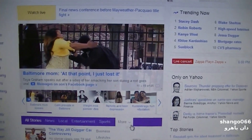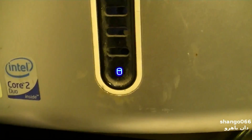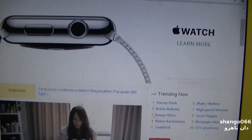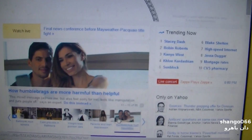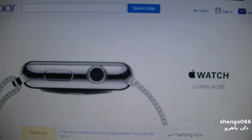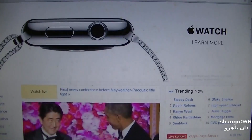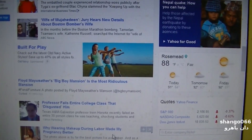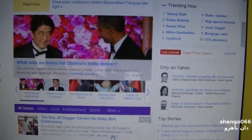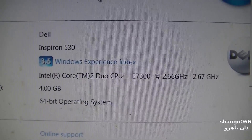But it seems like it's working pretty good. Looks like it's calming down a little bit. I'll just let it run for a few hours, then let it cool off overnight and try it in the morning. If it passes a test, we'll give it back to them and they can continue to use it. So that's kind of a spur-of-the-moment, unplanned Dell — I don't even know what Dell this is — Windows Vista computer power supply partial recap. Replaced all the swollen caps and now it works. It's a Dell Inspiron 530, 64-bit, 4 gigs of RAM — not too bad.